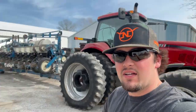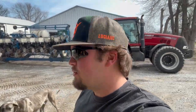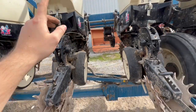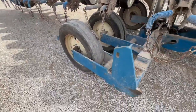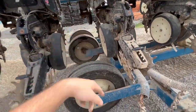What is up YouTube! Beautiful day, 65 and sunny here in southern Illinois, it's like March 8th. Got the 305 out with the corn planter on the back. That whole planter is pretty much rebuilt - redid both transmissions, closing wheel bearings, new belts on the meters, new chains, opening discs, inside and outside scrapers. She's pretty well redone.